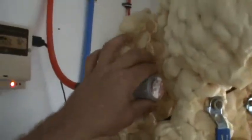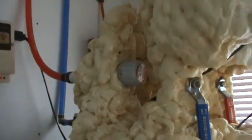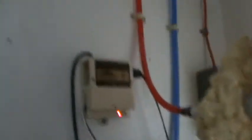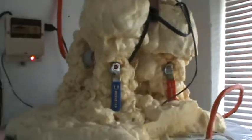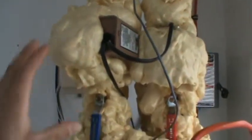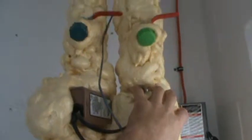Here we have a mixing valve, which allows me to keep my water tempered down to 120 degrees — that makes it safe and also reduces losses going through the piping system. These are the isolation valves which allow us to isolate the collector loop from the tank. There's a circulator pump and a motorized check valve here, though they're hard to see under all this foam insulation.